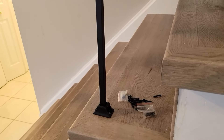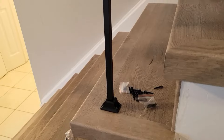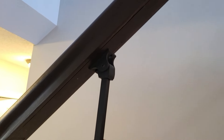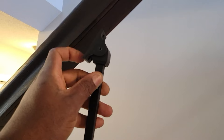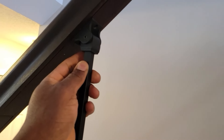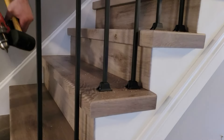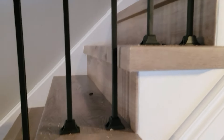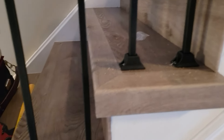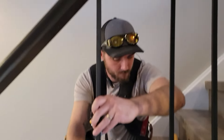When we come to the staircase, you can see we are using that same flat shoe at the bottom. But at the top when we come on up, we're going to need that swivel one. That's because the railing is of course going on an angle, so it's going to need that flexibility to be put into place. The other thing to note when you get to the stairs is the lengths for both of them are going to be different. Those first two start at the same height, but the second one goes up higher. Also those swivel shoes that go at the top do take up more space, so it's going to be really important that you measure each and every single one of these to make sure you are getting the accurate height for what you need.